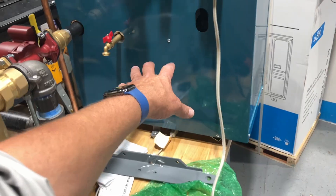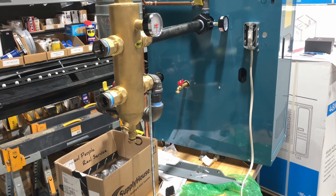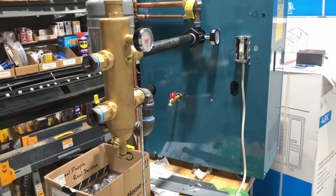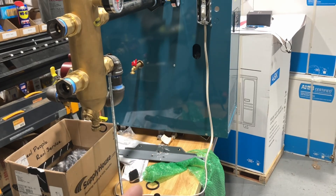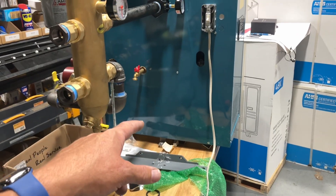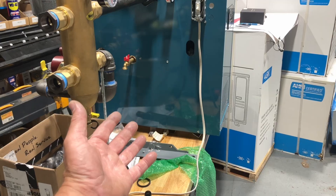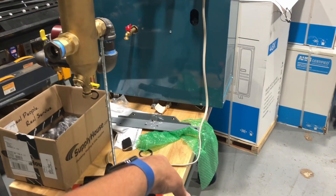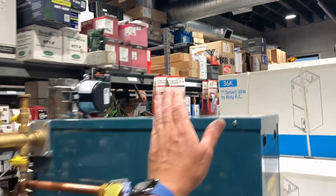It would be really nice if they made a little baby indirect water heater — imagine a little five-gallon water heater right here. We could make one: take a pail with a nice lid, coil some copper inside, and have a zone feed it. The coil would heat the water. We wouldn't keep it under pressure, but we could create an immersion-style heater that dips into the water — drain the bucket when needed. Pretty cool concept.